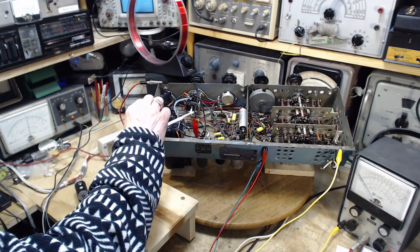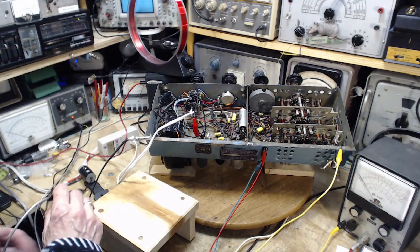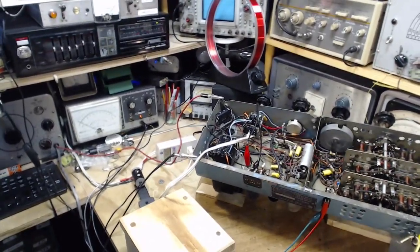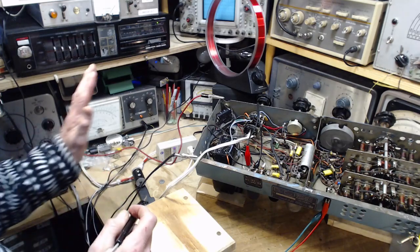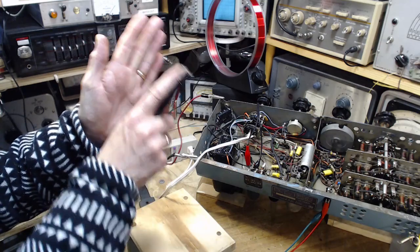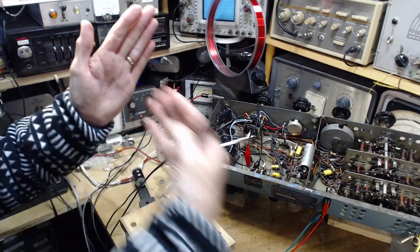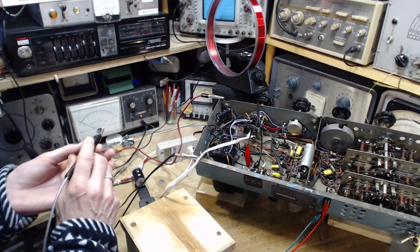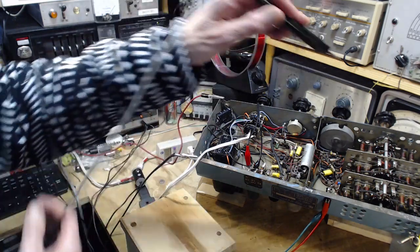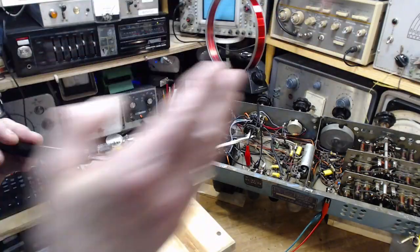Okay, now I want to make quite an accurate reading of this amount, so I may have to stick my head in front of the camera here. There's a parallax problem, right? The meter pointer floats above the scale. It's not right on the scale. So if you look at it on an angle, you get a different reading. That's why some of the better meters will have a mirror. See on this one? There's a mirror right here, and that's so you can look at the pointer in the mirror.